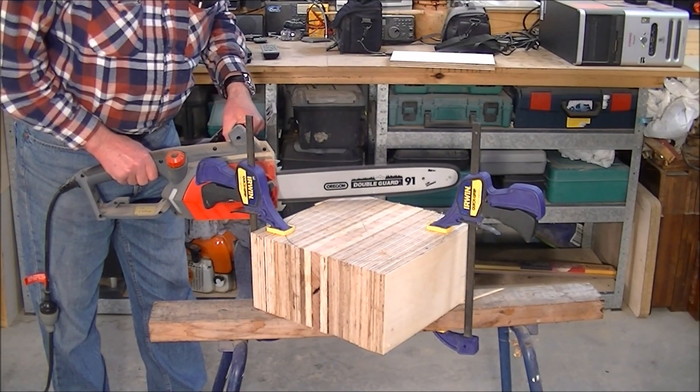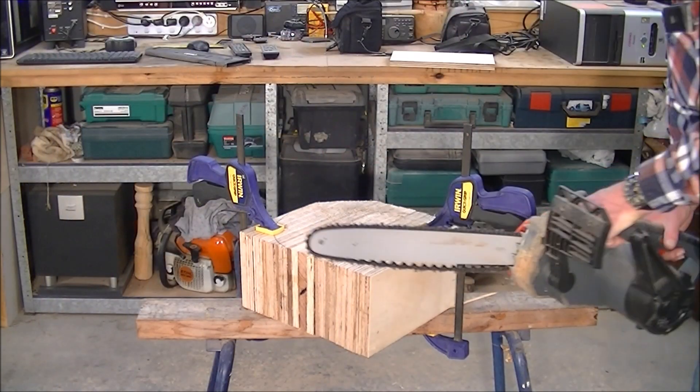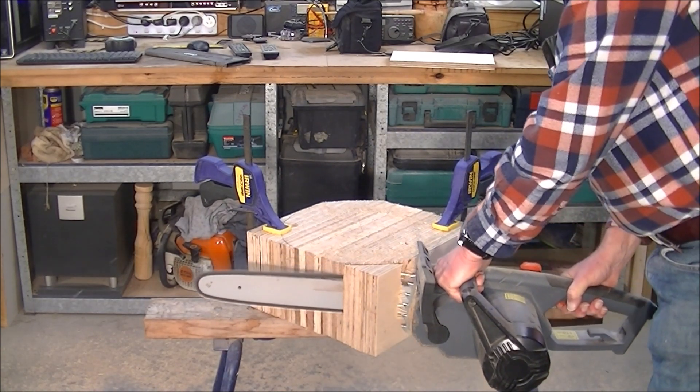This is the remedy I came up with — just knock the corners off. It saves a lot of work just removing the corners when you come to turn it up on the lathe.